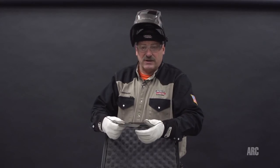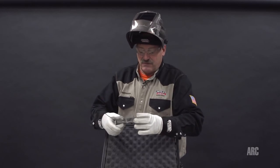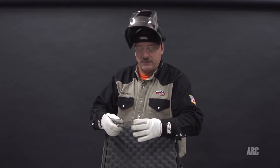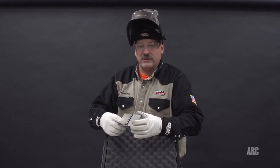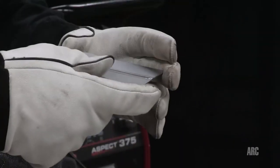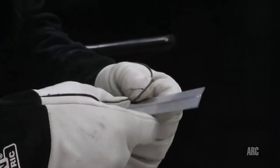To wipe the parts down clean before welding, use acetone with safe procedures and safe gloves, and when you're handling acetone, be careful with that. But wipe the parts down with acetone, remove any oil from fingerprints, generally separate titanium from other operations, and use clean gloves that have only been handling the clean titanium. That's all important stuff.